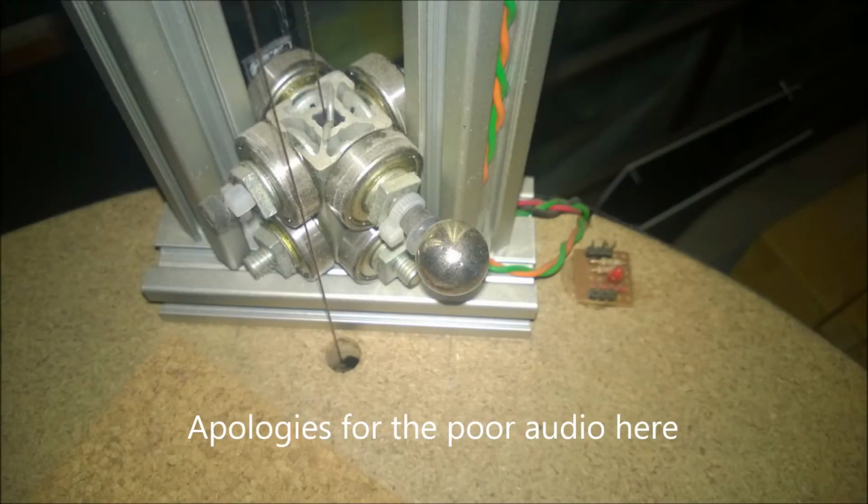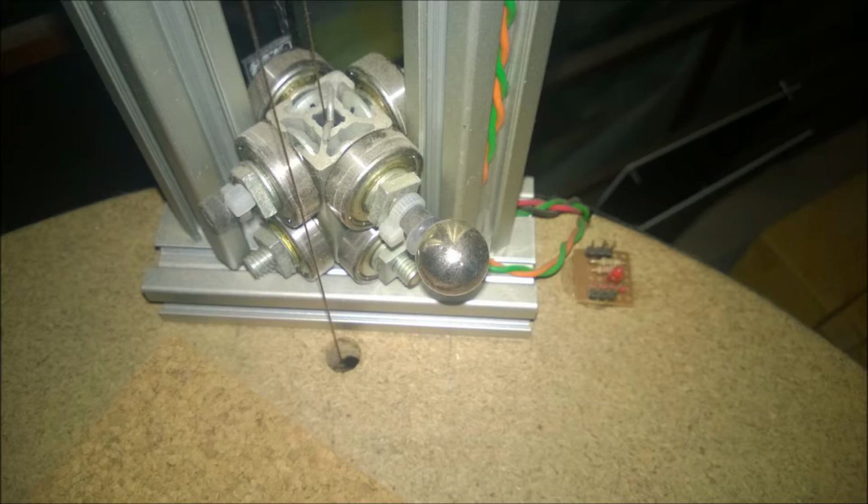You can see that the chrome ball is held onto the truck by a magnet, which in turn holds onto the bolt, which also supports the bearing. The magnet is encased in some heat shrink in an attempt to stabilize it. When this started to loosen up, I cable tied the heat shrink to the thread and also glued the ball with some hot glue. This was obviously before I figured out that it was actually the magnet in the diagonal rod and this magnet repelling each other in certain angles, which caused the joint to loosen randomly.